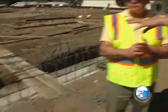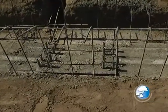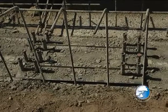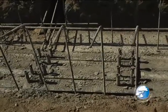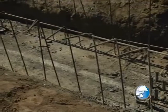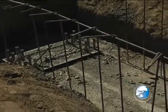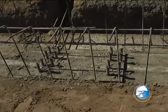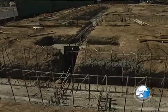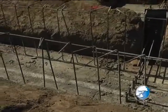We'll probably see that steel work in April, probably toward the end of April. So as we're looking into the trench right now, we see some steel footings there — that's where the steel columns are going to go. What you have here are all the foundations and the pour for the footings. The steel member columns will be bolted into this footing. As he's panning around and looking at those various conditions, you'll see the anchor bolts coming up and the nuts that the steel members will bolt to. And you can also see where the rebar, the steel rebar, has come up and is kind of angled out — that's where the slab will turn into.